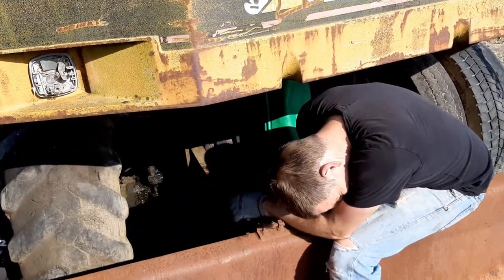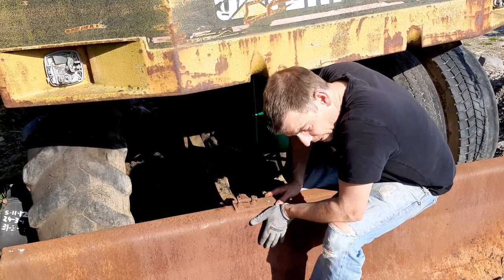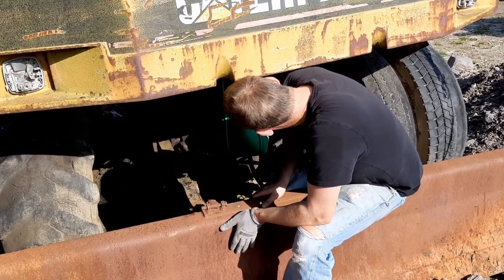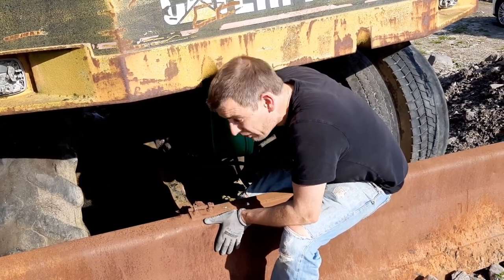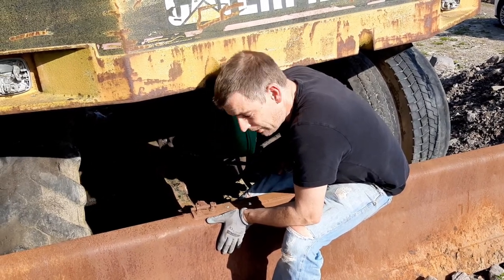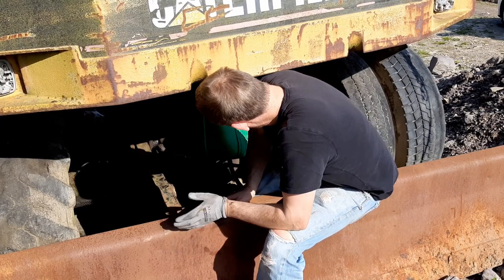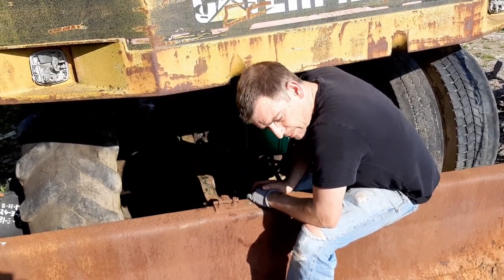Okay, so I decided I might as well just drain the diesel tank out through that return line. It's just cleaner than pulling the plug on the diesel tank, which I've done in the past and got covered in crud. Plus the fall in the machine is taking most of the water and things away toward the drain point. When I looked into the tank, it's actually leaning towards the outlet and the return, which we have in this case. So I might as well, while I'm here, just drain out the tank now, and we'll try and get some shots inside the tank then.